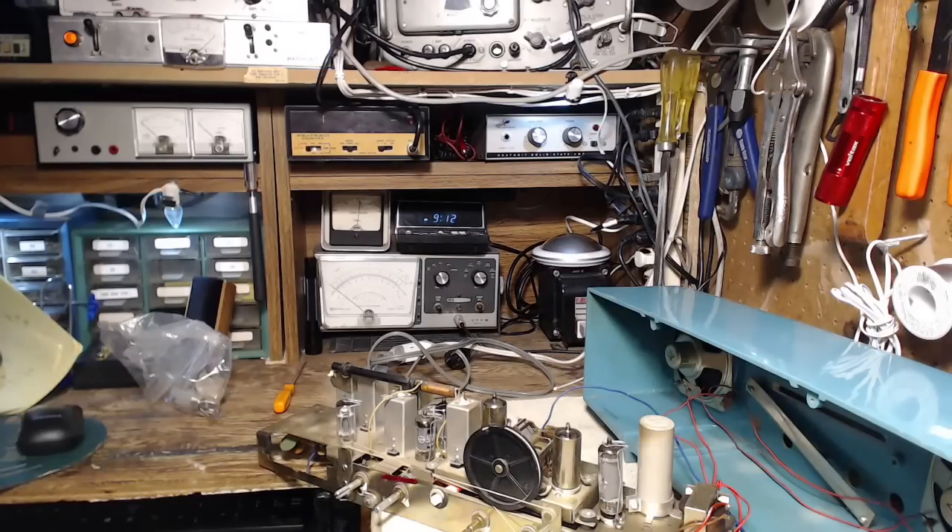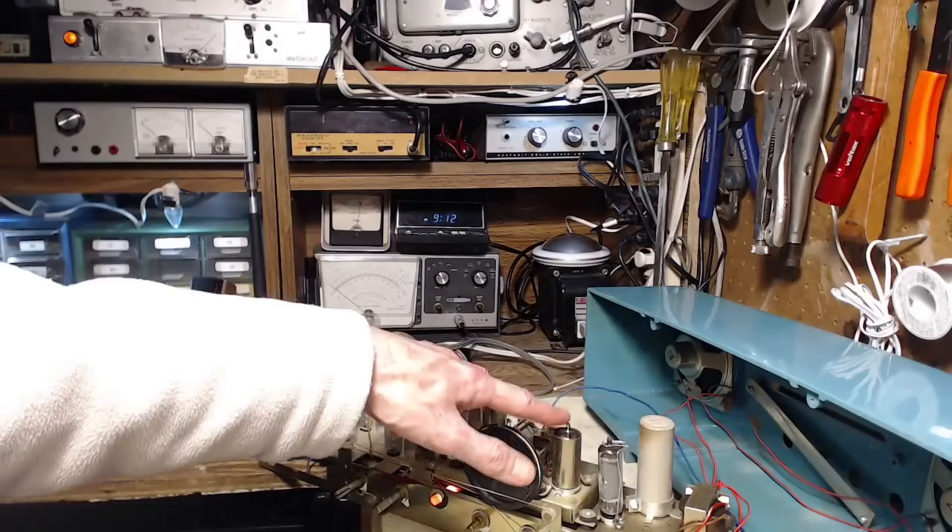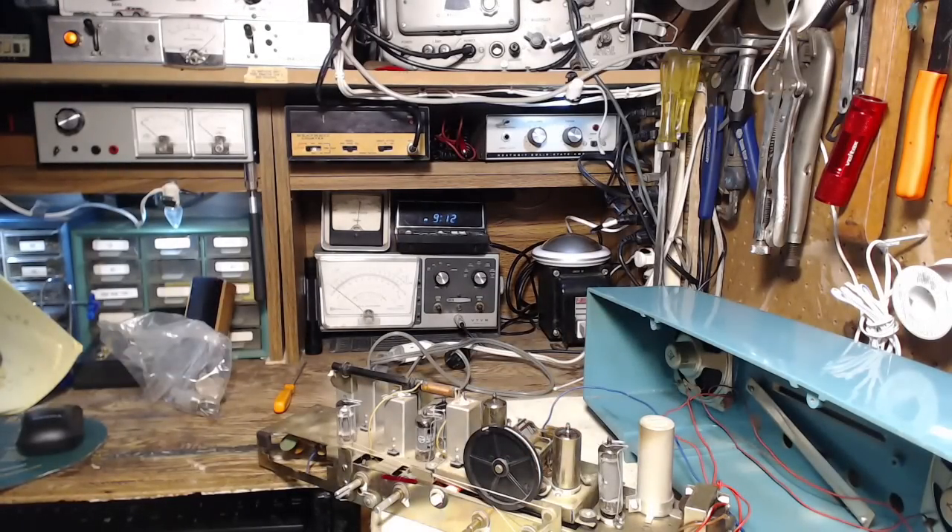We didn't do it here, but I'm pretty sure the AM works within 10–15 seconds, just as you would imagine. So the problem lies in the FM circuits. From the way the sound built up, I couldn't tell you if it's in the IF or if it's the detector. I'm not even sure if the detector has much plate voltage on it, or whether either of these two FM tubes have the voltages they need. So I think studying that schematic is a good idea, and I'm going to power it down.